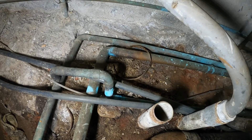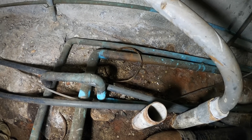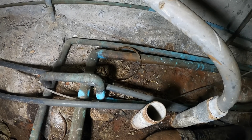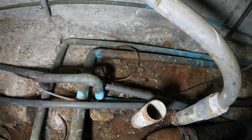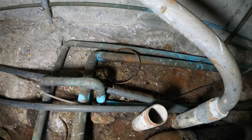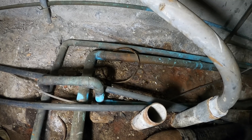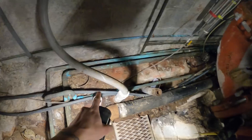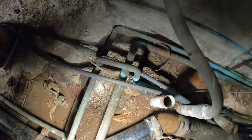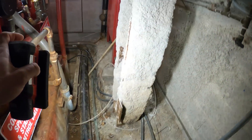Now when we turn on the AC and it's dumping water — which really isn't efficient because they're losing a lot of water — they want to put it in a closed loop where it gets recycled through a cooling tower, which they have. Once they're separated, the water shouldn't back feed and they will both go down the drain. This drain is coming through there, going down, coming through, teed off here. From here we're going to run a drain line going down.